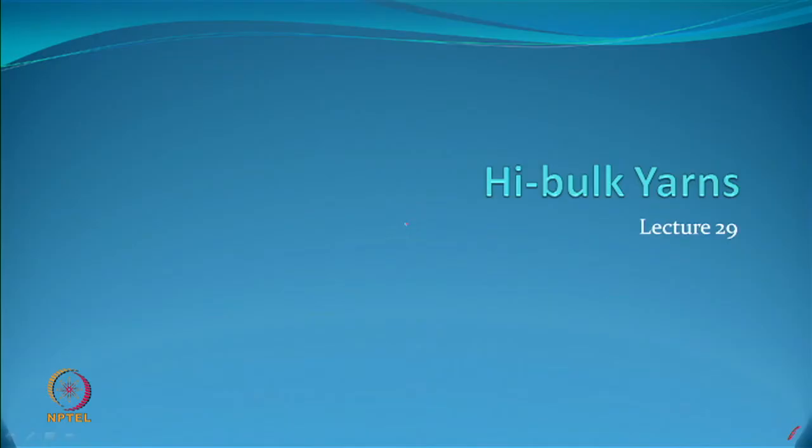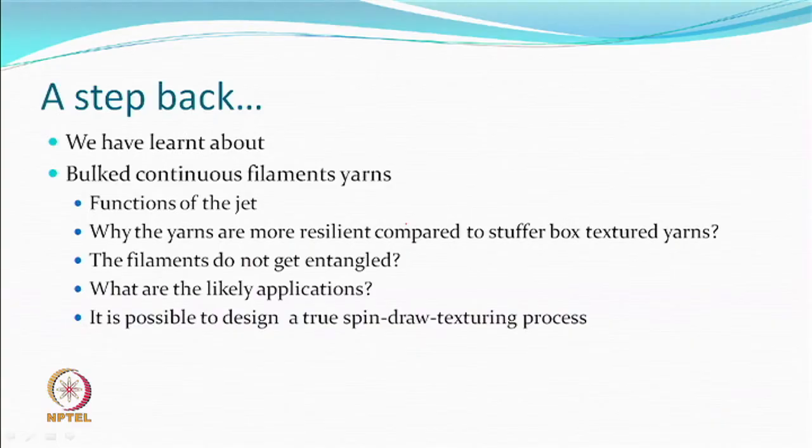So, we are taking up another topic called the high bulk yarn. We have learned something about the bulk yarn. This is slightly different in connotation and the process also is slightly different. Last time when we met, we had talked about bulked continuous filament yarn and the jet, the function of the jet, why the BCF yarns are more resilient compared to stuffer box, why the filaments do not get entangled,